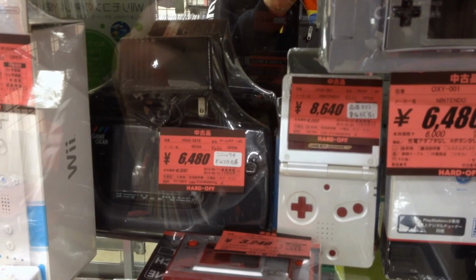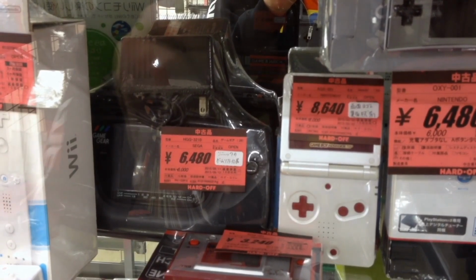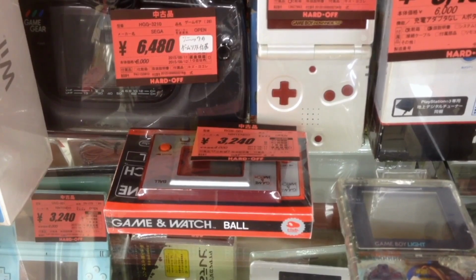Game Gears, even in Japan, and I think especially in Japan, I don't know about the American ones, but the ones in Japan, the capacitors are really bad, to the point where I would be really hesitant to pick up a Game Gear outside of the junk for full price, just because you don't know what's going to happen to it. You're going to need to get it recapped at a certain point, and it's really difficult to do yourself, because even if you're decent enough at soldering, the capacitors are so small. It's really hard to fix that system.